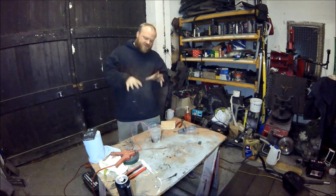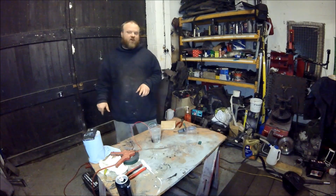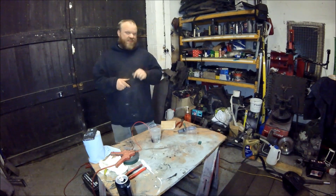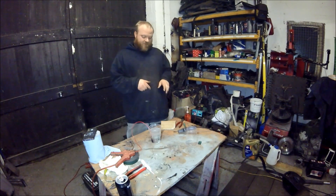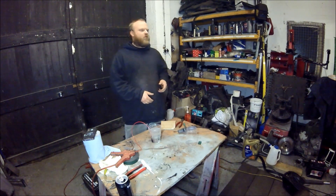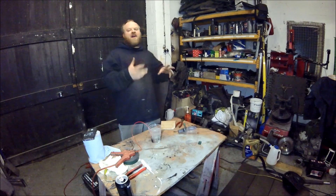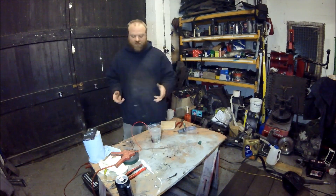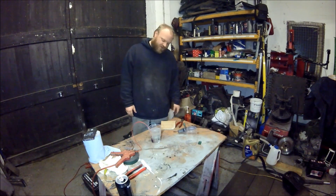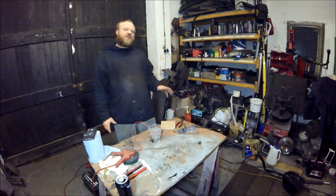To generate this amount of gas I've actually got two batteries tied together, running basically 24 volts, just to produce that little amount of gas. Theoretically, if you were going to try and make a car run on this, you would need a cell probably the size of the car and be dragging it along in a trailer. The amount of current it would require to generate enough gas - out of this setup you'd be lucky to get about 10 millilitres over a space of about 10 minutes. So unfortunately it doesn't really work.